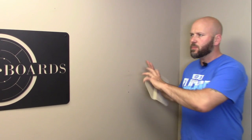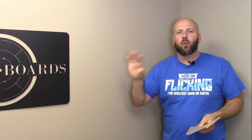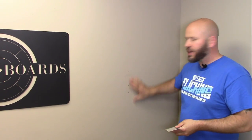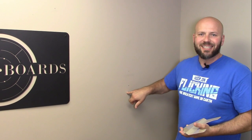Now, for our purposes, because we've got this as the backdrop for our YouTube videos, we actually want it a little bit lower. So if you're more particular, if you have an exact spot you'd like to have this mounted, I'd encourage you to find the exact center of where you want your board to be mounted, put that mark on the wall, and then come down 4 1/4 inches. I've already got this marked out to save time in the video. So I've got 4 1/4 inches, then hold the plate up to mount, to mark the second spot on the wall.